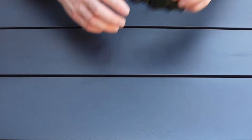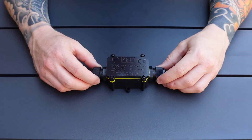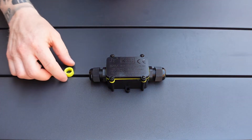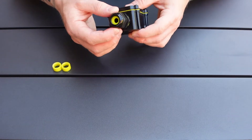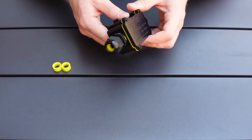You don't need a lot for this job — cable strippers and a little screwdriver, that's about all you're going to need. In the kit you get the box itself with the two weatherproof glands on the end, and you get a few different waterproof seals. You get the ones for 2.5 flex, and already inserted are the weatherproof seals for the 1.5 flex, which are the ones we're going to be using today.